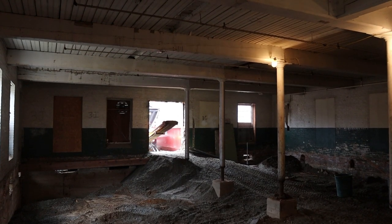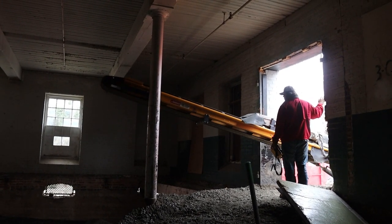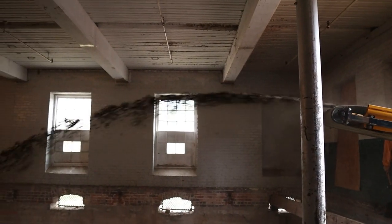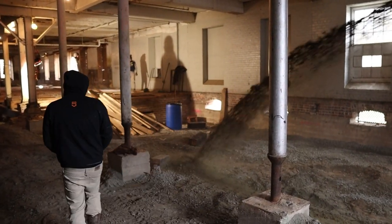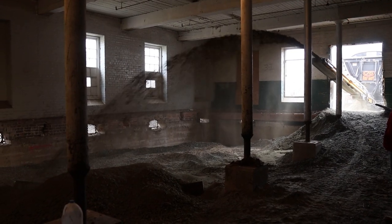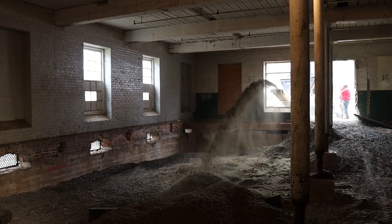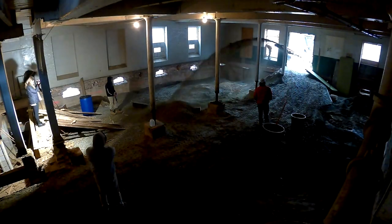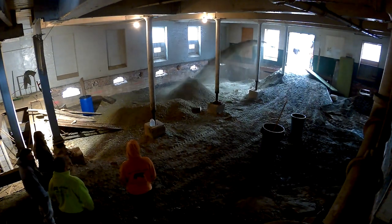We were at the mercy of how efficient the quarry was and how far away it was. Roads were shut down, the truck had to take the long way, the quarry's loader was down and backed up. At one point he sent me a picture of a mile-long line of dump trucks. You're paying this slinger truck by the hour and he's only running every three hours — your cost per yard goes astronomically high. Even on the most efficient day, they could only process about six loads. So we went back to loading the next 800 tons of stone with the skid steers — two of them going — and we could actually lift about four feet per day with the 57 stone. We had 12 feet to go total, so not so bad.